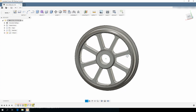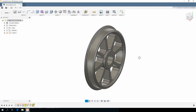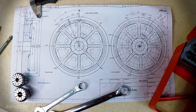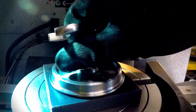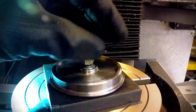I will use the rotary table to cut out the spokes. I'll be working from a drawing which I made, in which I've calculated the angles and toolpaths for the procedure. I'll begin by locating the turned wheel on the arbor and rotary table setup used in the last episode. I have the digital readout zeroed on the centre of the rotary table, which will allow all cuts to be referenced back to the centre point.